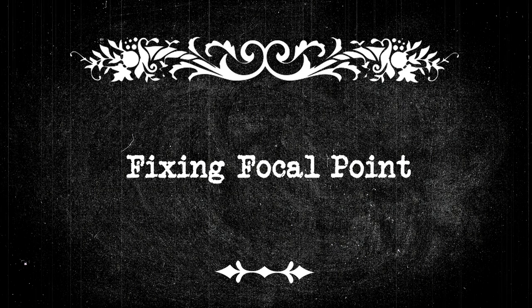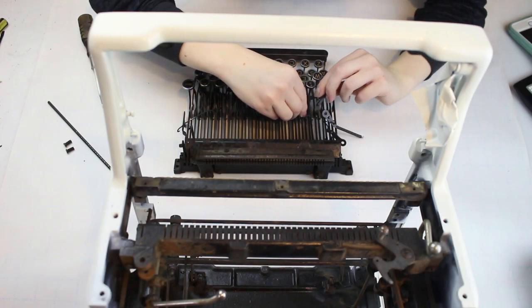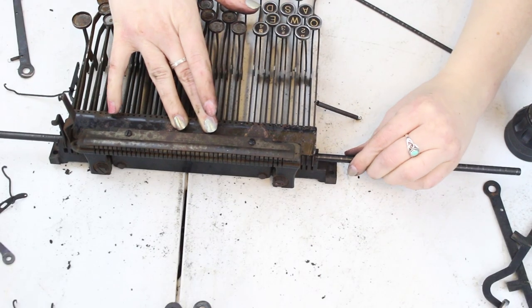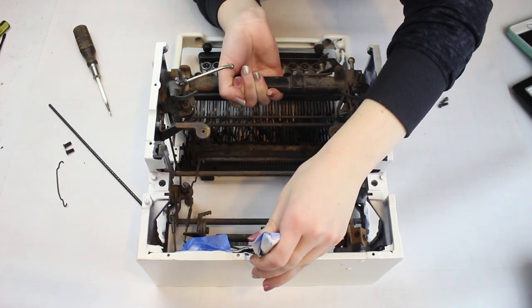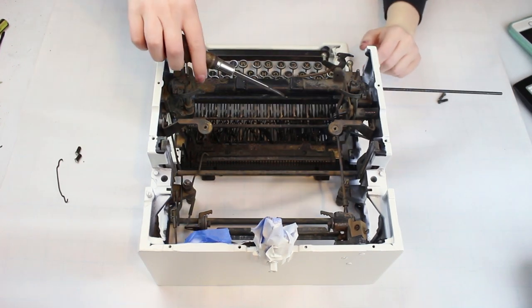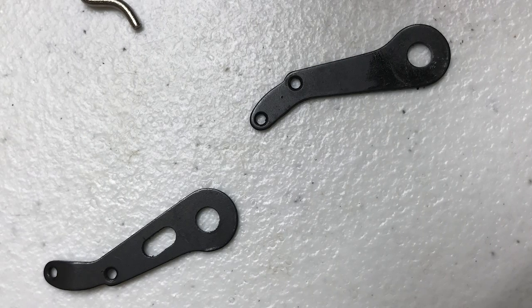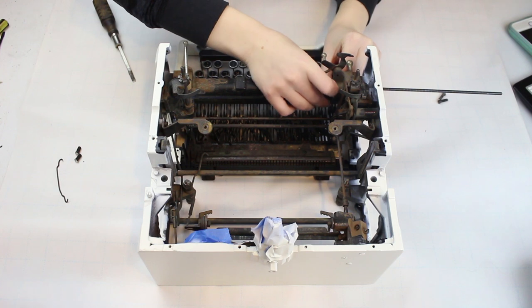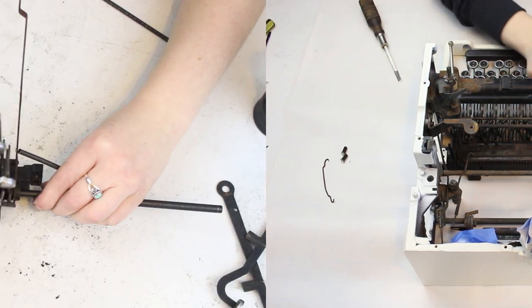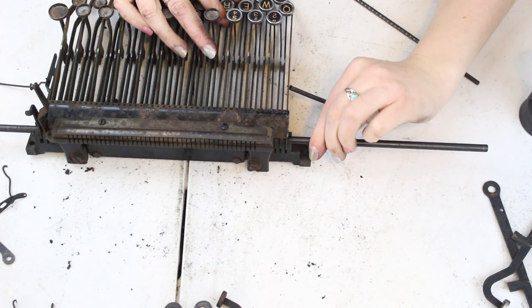One issue we had throughout this process was knowing how to properly adjust the typewriter. We weren't sure what had been replaced or what was original to the machine — clearly somebody else at some point was in here before me. When I replaced the key toppers, I did it as a unit, placing each key lever into the framework where I had removed the old ones, then placed the entire unit into the keyboard area of the typewriter and linked everything back into place. There's a series of linkages here, and it gets confusing really fast. Right behind the front panel is a bar with many slots for these little curved pieces. These curved pieces link the front of the key lever to another linkage piece that attaches to a pivot point of the key in the basket. By pressing on the key, the front of the lever pulls down this linkage and pivots the pivot point, lifting the key or type slug.